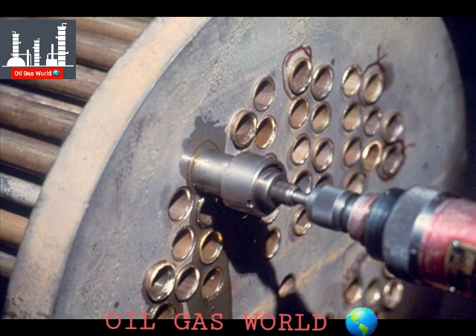Then, as you expand the tube during rolling, the oil will squirt out. When the oil stops squirting out, the roll should be complete. This method is especially helpful when using a pneumatic drill motor, since there is no positive way of knowing when a tube is properly rolled, as there is with a torque gun.